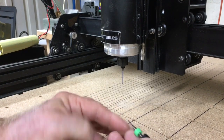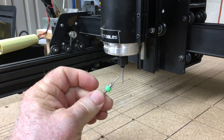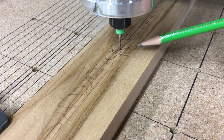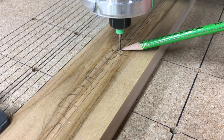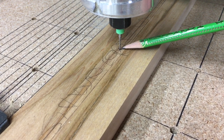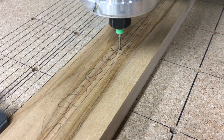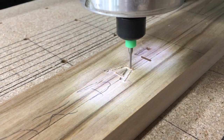For this project I'm using the 1/16-inch down-cut bit obtained from the Inventables website. Going through the checklist, one of the things I often do — especially on something like this — is set the XY axis first. Right here is my XY axis; I lowered the bit down and moved it exactly into place. Now I'll raise the bit, get the Z probe, and zero that.